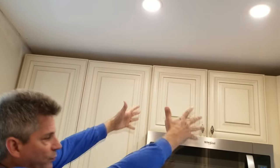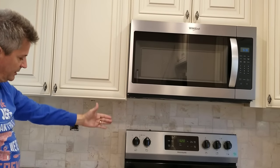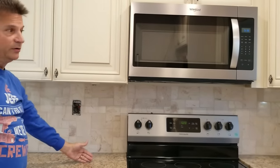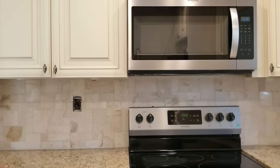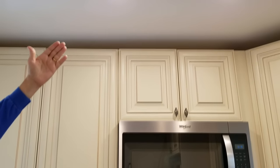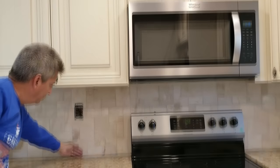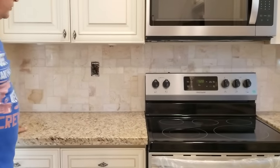The reason is that these lights have a big down pattern — that's why they're called down lights. The light spreads as it goes down. What happens is it comes down and hits the bottom of the cabinet, which can make a shadow on the counter. But on my counter there's no shadow, because I have the lights moved far enough in front of the cabinets so the light shines all the way to the back corner without causing dark shadows.